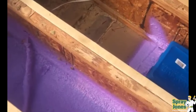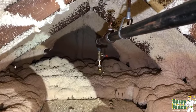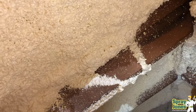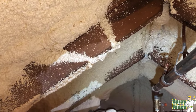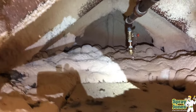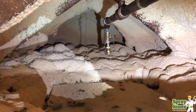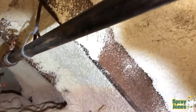Point number six is who's going to verify your work. You put the sheetrock up — nobody wants to get into an attic and climb out towards all the edges to visually confirm the spray guy has done his job properly: gotten it onto the plate, sealed all the penetrations, made it consistent. Verifying work is far more complicated in an enclosed attic. The lighting is poor. Obviously if you've got a large attic with lots of room and you've strung some lights in temporarily, that changes things.